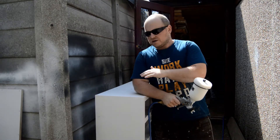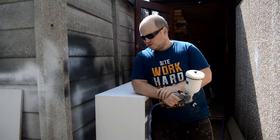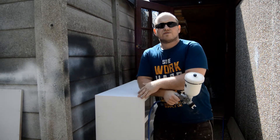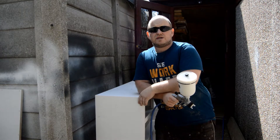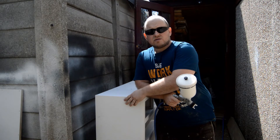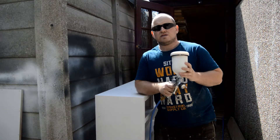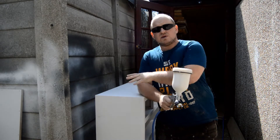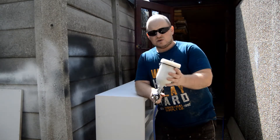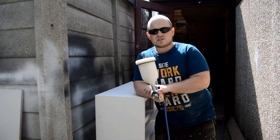Welcome back. Now that we've filled all the holes on the cabinet and given it a good sanding, we've given it a few coats of primer and today we're going to be using the actual paint to finish it off. It's going to be a white unit, so I'm just using my spray gun here — it's an HVLP gravity spray gun.